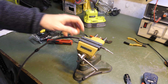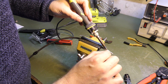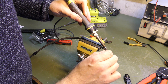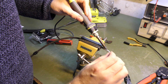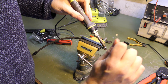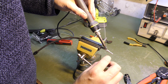I'll solder this as well. I have the solder out and I have the Ryobi soldering iron — I did a review on this iron and I really like it. A lot of people have been talking about it not being temperature regulated, and yeah, you can't do that, but it's very hot so for stuff like this where you just need to move a lot of heat in a short time, it's very good. I'd pick something else for fine electronics work in later videos.